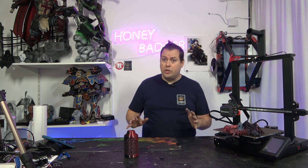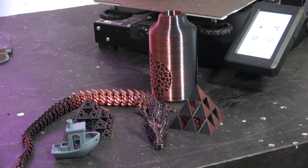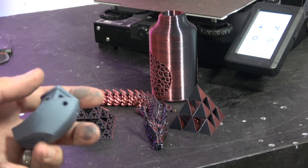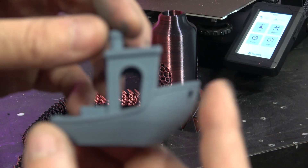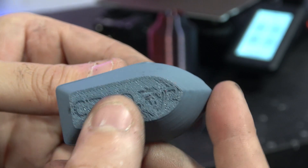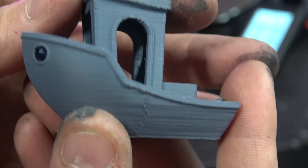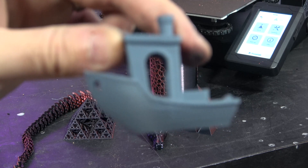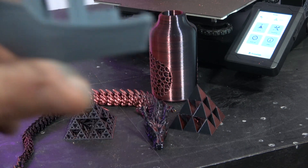Let's take a look at some models and we'll show you what the build quality looks like. Most of these prints are done in iWeColors dual colour filament — it's a silk filament, so it really shows up layer lines. The benchy is done in eSun's PLA+. You can see on this benchy we have a pretty good result — some layer lines on the bow, a pretty good finish on the surface, a little bit of an issue on the back. The bridging isn't terrible — it's an acceptable benchy. This took an hour and 20 minutes at 60mm/s, so the acceleration on this printer is clearly not high.